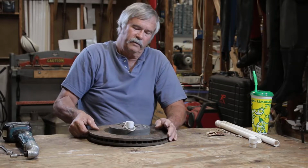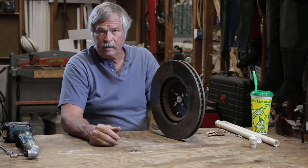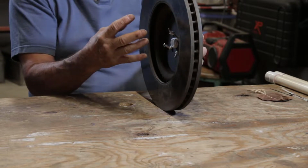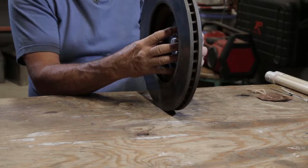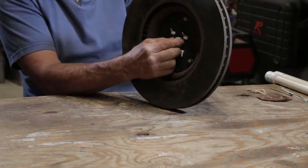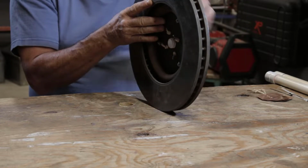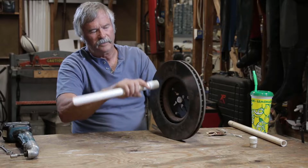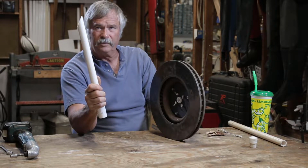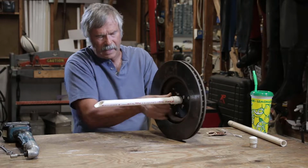So that experiment involved getting some wheel rotors, which are heavy. This is 20 pounds. You can get them for free. The auto shops just throw them away. So you take and get a disc, mount it on the rotor, and then get a 3/4 inch PVC male adapter. It's threaded to go through the disc, and you can insert a PVC pipe on the top end. So the reason that you want that is because you can get another fitting and glue it on this end. You've got it beveled to go into the bottom easy. And what you do is you screw this in on the underside.